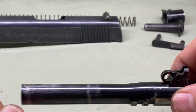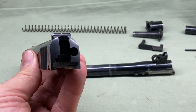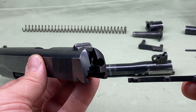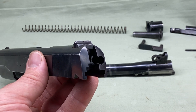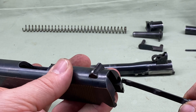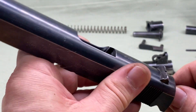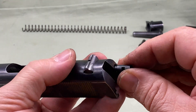This hole matches that curve. If you try to put it in backwards it's not going to match up and look right. My pin's back in my barrel. I lay it down inverted because I'm going to put that together in that same orientation. I'm going to work with the back of the slide right now. The first thing I do is the ejector because I've forgotten it before - put the firing pin in and the plate and everything else and then realize there's the ejector. I don't recommend putting any oils on it; that's just me. I have a dehumidifier so I'll put it in straight, but if you do, just a light coat around the points that touch. I put it in straight away. This one came out a little tougher and it's a little bit bound in there because it's got a curve to it, so I'm just going to play with it gently and may have to change the orientation a little bit.